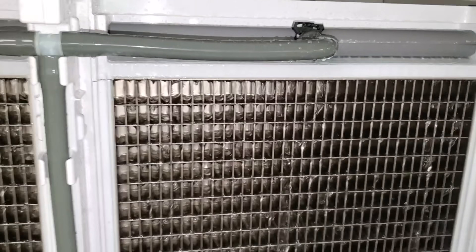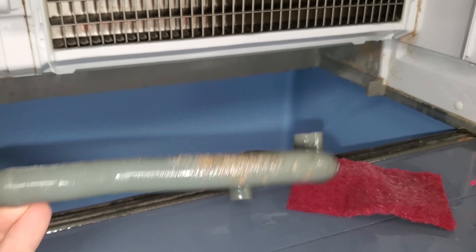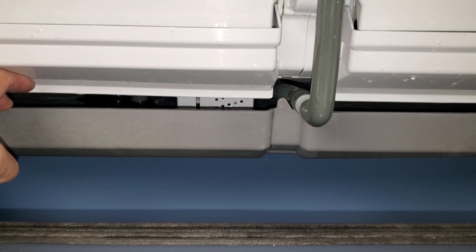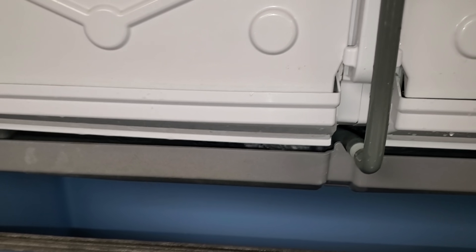We'll disassemble it once we give it all a wipe down. The machine is all disassembled now, and I want to show you underneath here. I'll often use the bin as a catch place. You want to make sure you get in here to the water level sensors and really look inside the hoses to make sure there's no massive amounts of calcium. Also underneath — this is the hidden place a lot of people forget about, because when the water splashes it builds calcium up there. It's nice when they have a sink tucked in the back. Now we're going to put it back together and run sanitizer through the machine. The process for sanitizer is exactly the same as cleaning it — put it into clean mode and add the appropriate amount of sanitizer. You want it to foam up — the sanitizer is really foaming inside there. That's part of the process. You just have to make sure you rinse it all out. The sanitizer is all rinsed out. I let it go through self-rinse and also dumped the drain pan, flushed it with good water myself a few times. Put it back into freeze mode and we're going to watch it make a batch of ice.